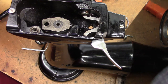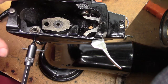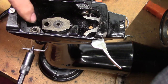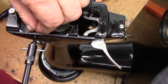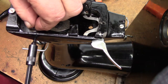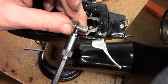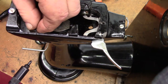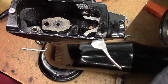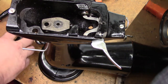On this machine, one of its problems was that somebody adjusted the set screw in this pivot point hole incorrectly. You'll see there's a wide groove ground in where that set screw rides into. If it's too far in or too far out, it causes a binding in this linkage. So when putting this back together again, that's an adjustment we're definitely going to have to make.